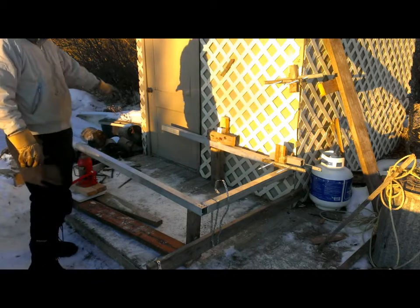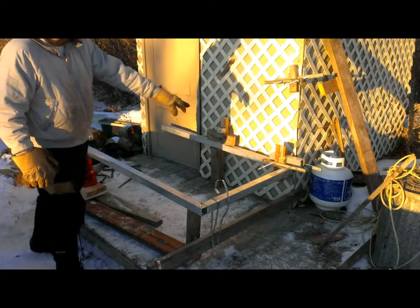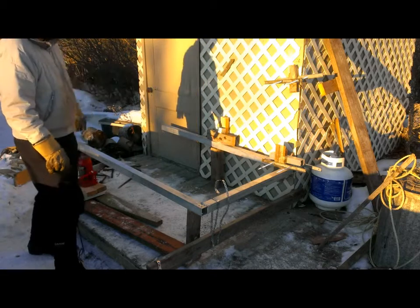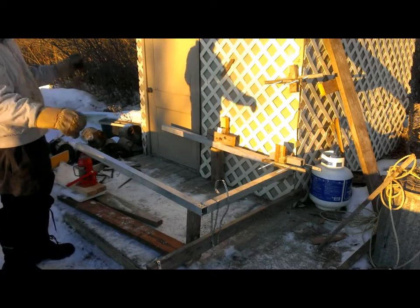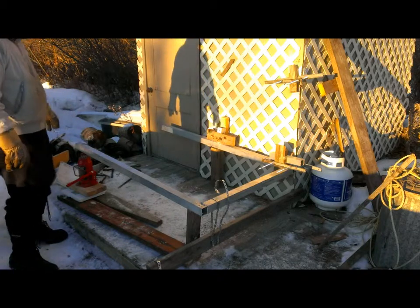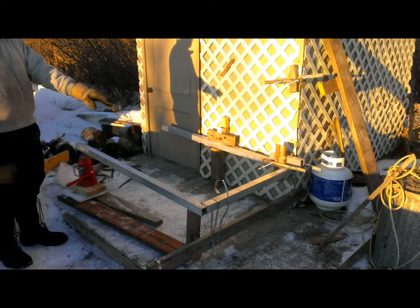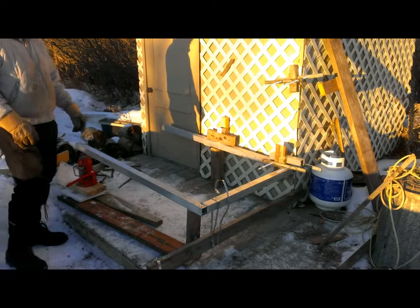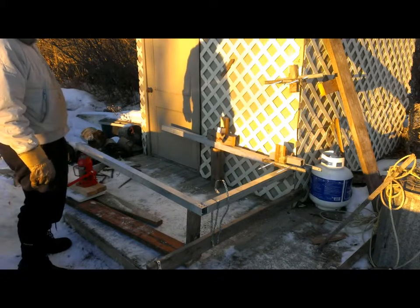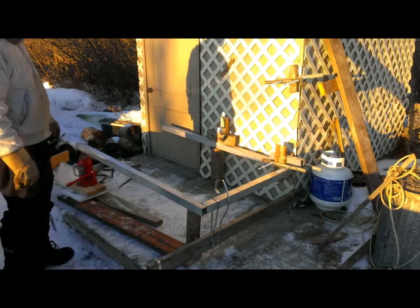The idea is we're holding that aluminum tube on the shed in location. There's a weld beside the shed. There's a weld here. I haven't come up with a way to do the torque on just one tube, so we're doing it on here with the scale at 200 odd pounds. This gives me almost 1,000 pounds of twisting torque, which is well, if it doesn't break then it's doing really well. That's the general idea of the test.